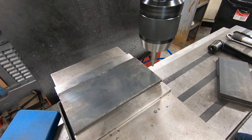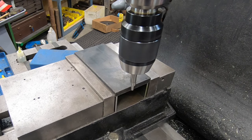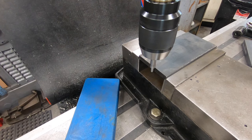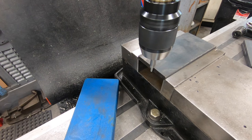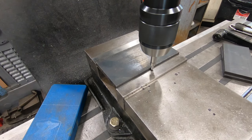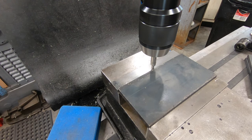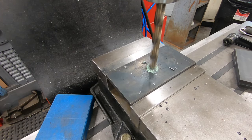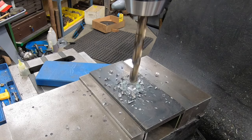I've got these pieces of flat bar that are about the same size as the machine skates that I want to make some, I'm calling them pivot plates out of. Essentially, they'll sit on top of the skate and it'll be allowed to pivot. So if the machine that's sitting on it, or whatever it is I have sitting on the skate, if I need to adjust the direction the skate is going, it shouldn't want to slide out from underneath the machine. Well, at least that's the hope.